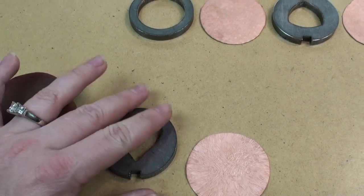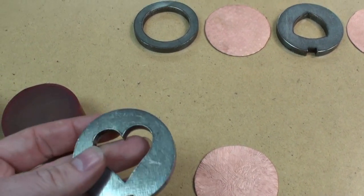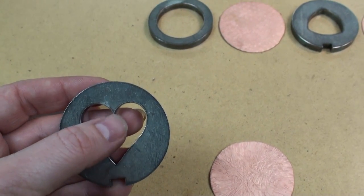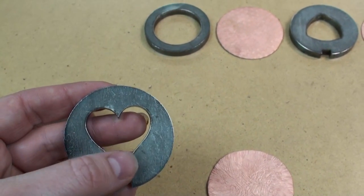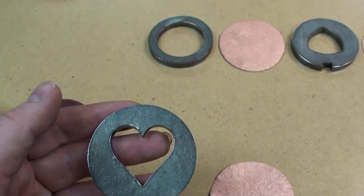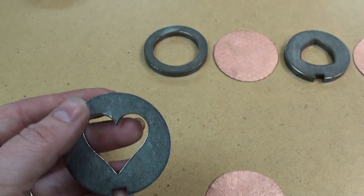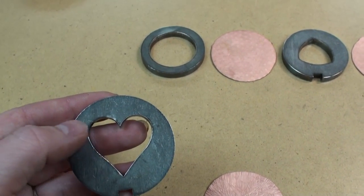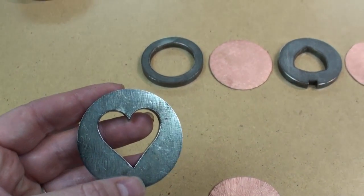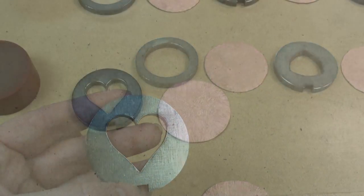One thing that you do want to do when you use one of these dies is prep it, and that's by breaking the edge, because they come with a pretty sharp edge and they'll shear right through your metal. So spend a little time, go back to my YouTube channel. You're probably already here. If not, you can go to YouTube and look for my channel. My tag there is KC Jewel Box. And I do have a demonstration on how to prep your silhouette dies.